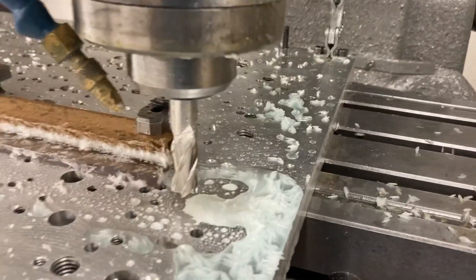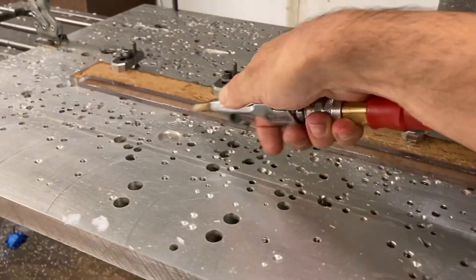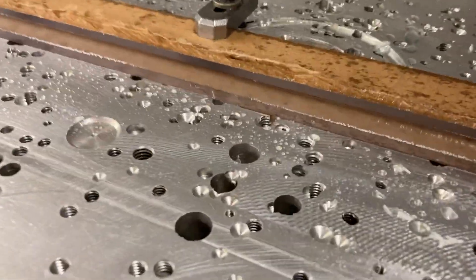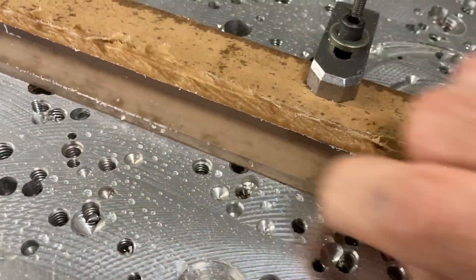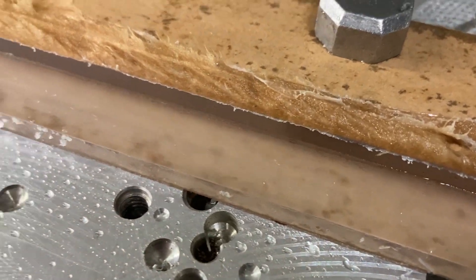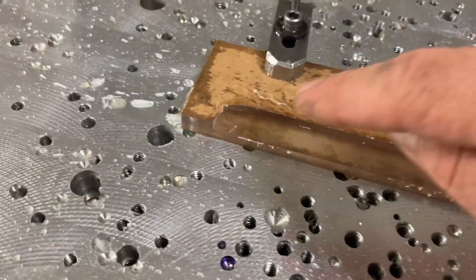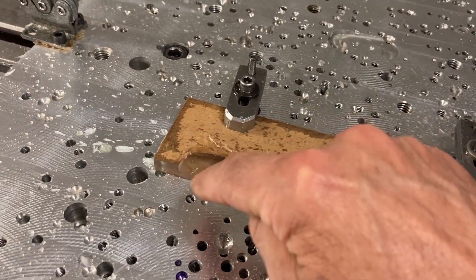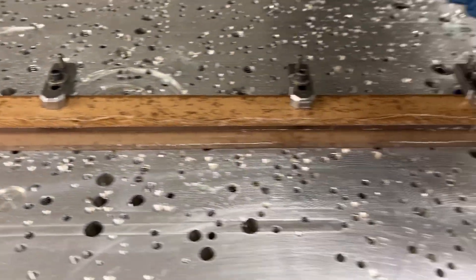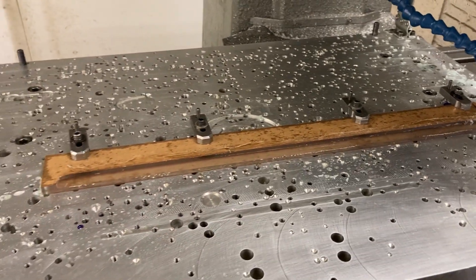Coolant off, spindle off, spray away the chips. I'll deburr afterwards - there's really not a whole lot of burr on this stuff. You get a little on the edge but it comes off easy, almost take it off with your fingernail. The finish is okay, doesn't look bad, it's good enough. Then like I said, after I bring it to the proper depth of 0.265, I'll change to the one-eighth tool, come in with that one-eighth tool, take out that quarter inch radius and make it a 1/16th radius, and then these babies are done.